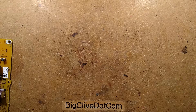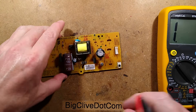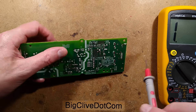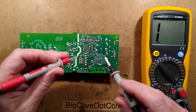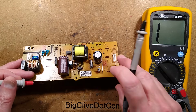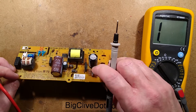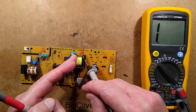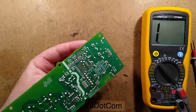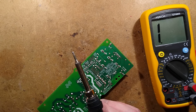Let's start probing about. The fact that it's a dead short circuit is good because that suggests — well, the first suspect most people would think of would be the capacitor in the output. It is not domed, which doesn't mean it's not at fault, but we're getting a dead short across the back of this on the diode continuity test. My first suspect is actually the diode package here — one of the diodes in that package may have gone dead short. Normally you'd expect to read a diode drop plus a slight resistance of this winding, but I'm not getting that. Let's remove this diode and test it and see if the fault goes with the diode being removed.